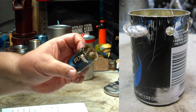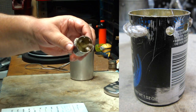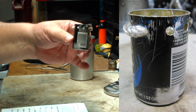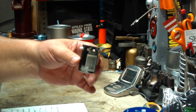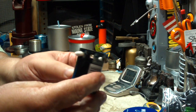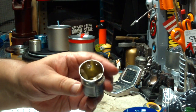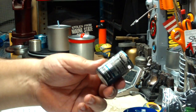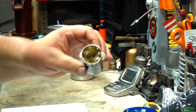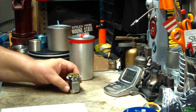It was from an axe can. The diameter of this is 1.36 inches or about 34.8 millimeters. It's a little more than 2 inches tall. I punched 8 fairly large jets into it, which I think probably failed. So then what I did was put some fiberglass wicking in it and went on from there. I can't find my notes on this, but it's probably something that didn't go as well as I thought it would, but I want to give it a try here today.